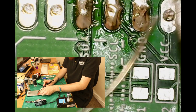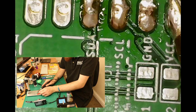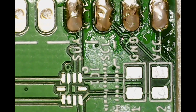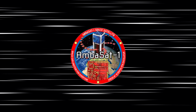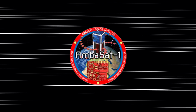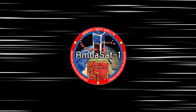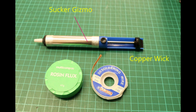Now usually if a bit of extra solder trickles through to the rear and ruins our flush solder, you can turn the PCB and just run the iron over it to allow it to reflow and run smooth once again. But to be safe, I wanted to cover some basic desoldering techniques to help cases of excessive solder. Now there's a few techniques when it comes to desoldering, but I'm going to stick to the basics using a sucker gizmo and copper wick.